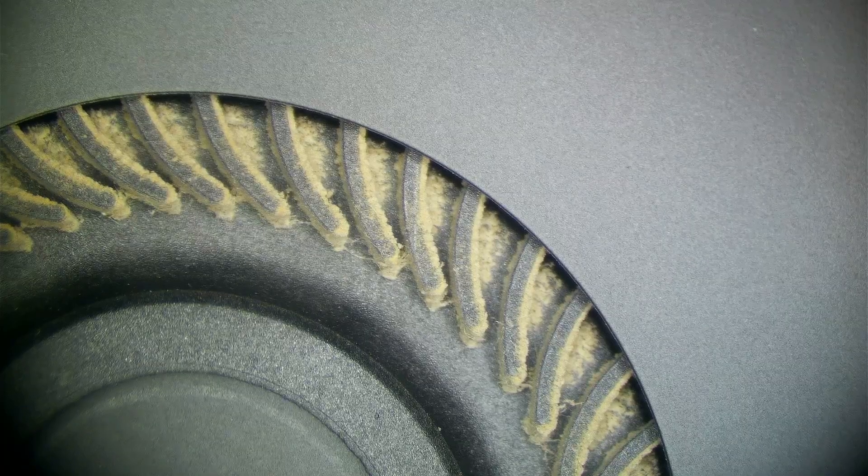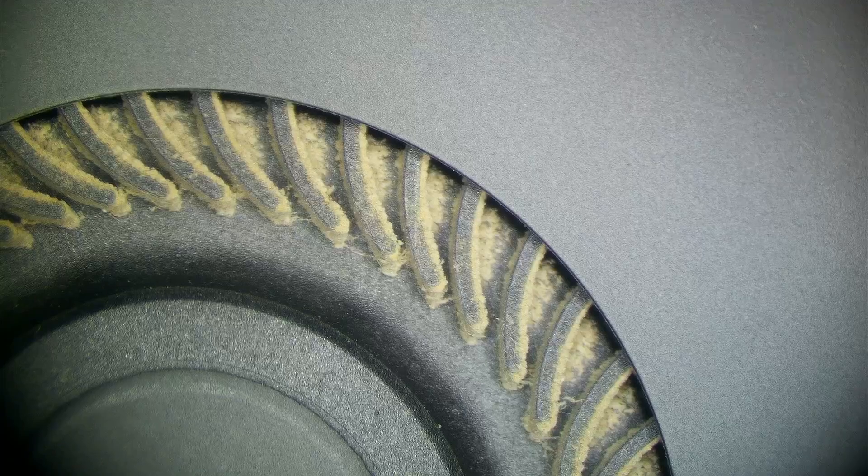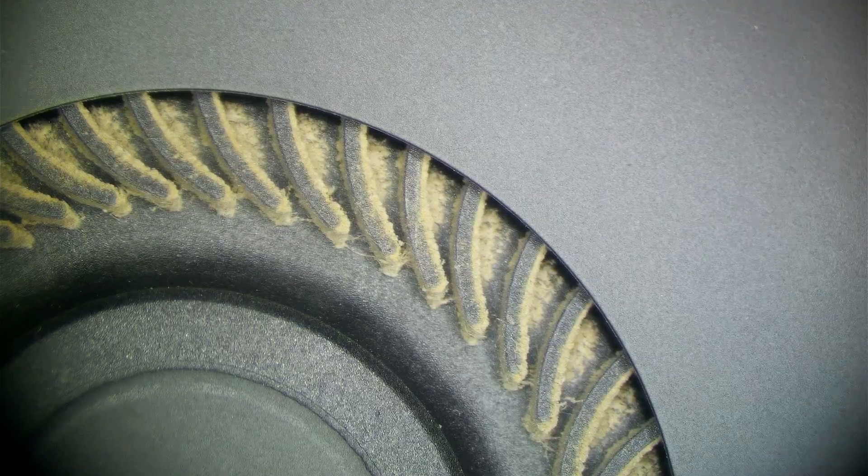The board has cooled for about 45 seconds. Let's plug in our charger. We get a green light, then orange light — the SMC just reset — then orange again, and that is a spinning fan! This appears to be fixed. I'm going to ultrasonically clean this board because this didn't look like liquid ingress — more like a piece of dirt that got some condensation and corroded. If it happened on that chip, it may have happened elsewhere, so I want to rule that out.